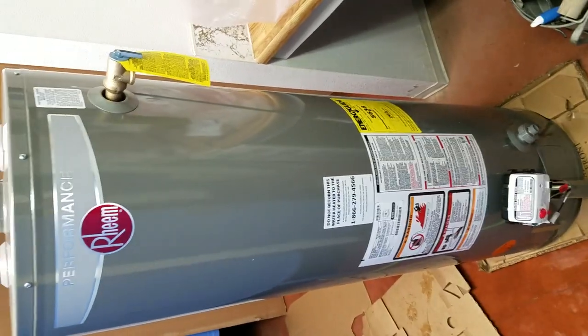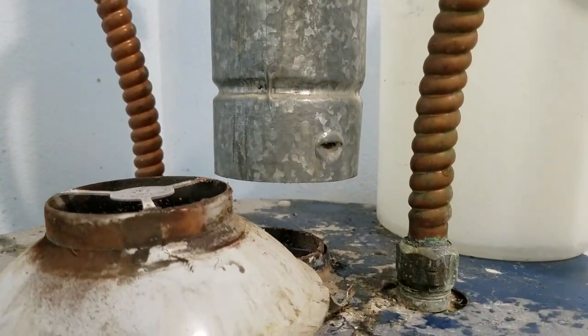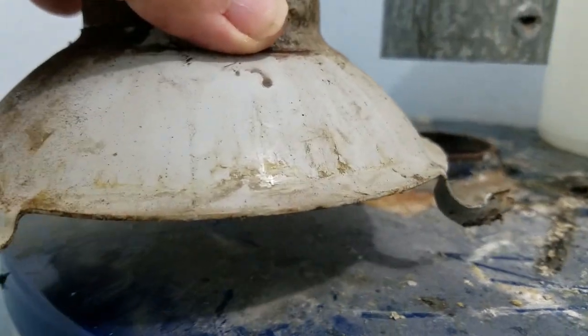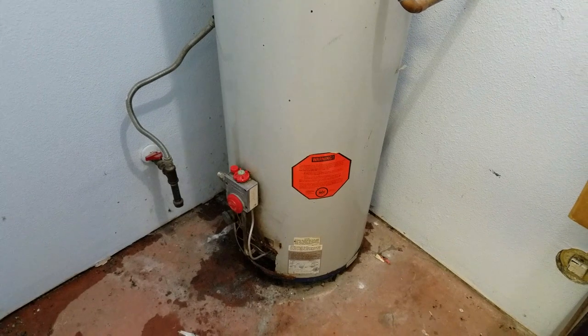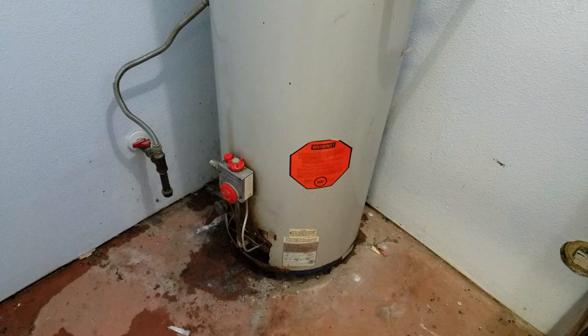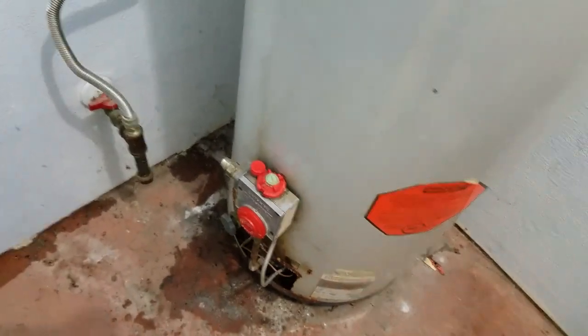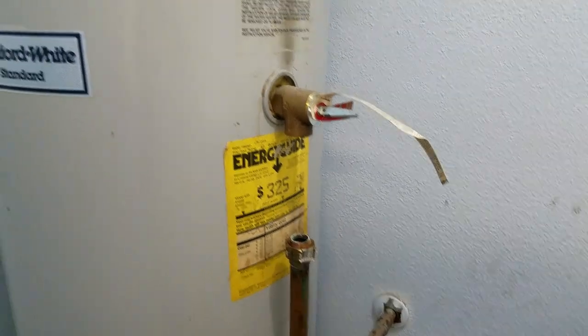We're going to put this new unit in right here, so let's get started. I did not want to disturb the chimney — I'm going to try to get this reinstalled without messing the chimney up. What I did is I took these tabs and twisted them 180 degrees and bent them up so it would slide out from underneath. The tank is drained, the hose is out, everything is broken free — gas unhooked and turned off, overflow valve unhooked, supply line unhooked, and chimney unhooked. So we're going to yard this old beast out of here.